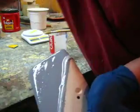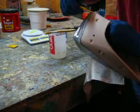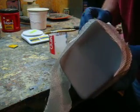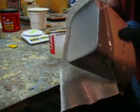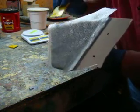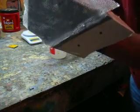We'll put our resin on there like so, and then we take our glass that we already have cut — and this goes on a special way. See that little lump right there? That has got to go right there. Just wrap her around there, now we take our squeegee and get her on there. We don't want to squeeze too hard going into this corner because it will squeeze all our filler out and we'll have a void. So you just kind of be careful where you've got your filler, and we'll just work it all the way around.